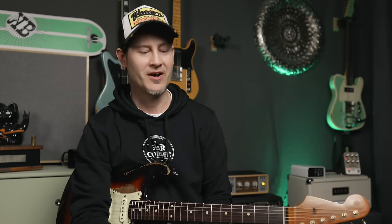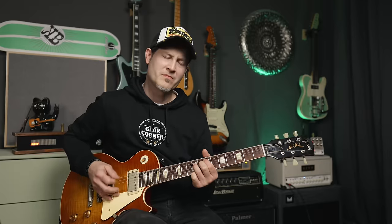So there is something to it, like tiny little differences if you really, really pay attention. But honestly, if that was it, like that's all those clipping options give me, I'm like, okay, what is the point in paying any attention to the clipping diode? Like, come on. But if you crank the gain some more, you actually hear much more of that part of the circuit of a Klon-style pedal, the clipping part, the actual overdriving part.